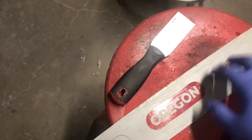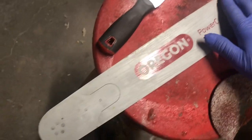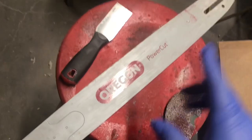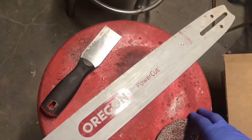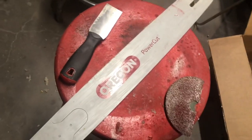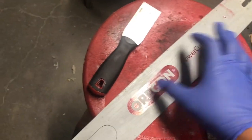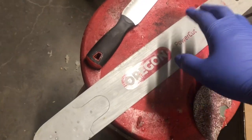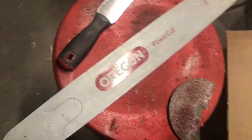The thing to remember with a rotary sander is if you get down to the metal, you want that nice even with-the-grain look. If you get down to metal with a rotary one, you're going to have to hand sand all that out, and depending on the roughness of your sandpaper you're going to be sanding for a while. With a belt sander, it won't be a circular pattern but you'll get jagged little weird notches everywhere which you'll have to sand out.